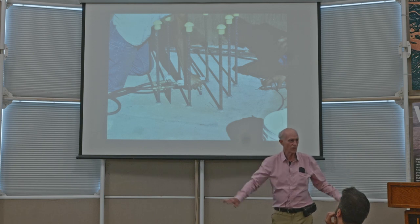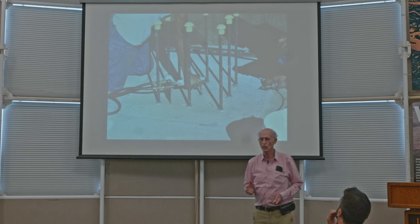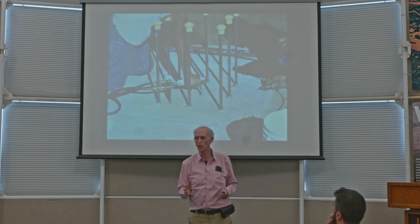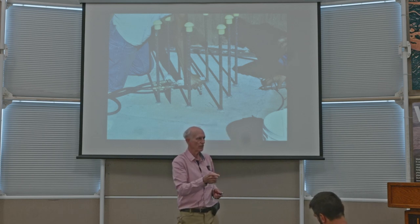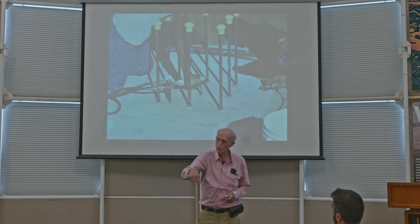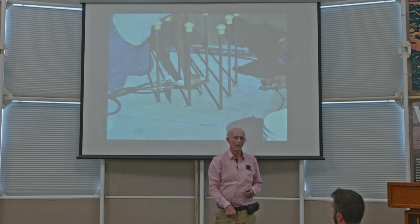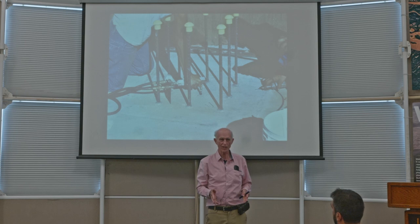Now, here's what I was going to say about the liner. Underneath, there has to be a metal liner, otherwise it leaks. But then you have to ask yourself the question, what about structural columns? There are all these concrete columns that you see all the way in Biosphere 2, and you know perfectly well that they go through to a foundation in the ground. Okay, but wouldn't that mean there would be a penetration through the liner?